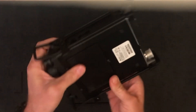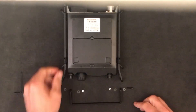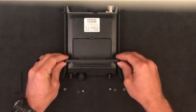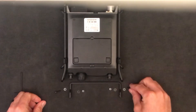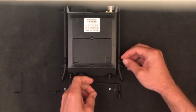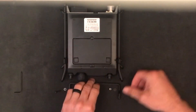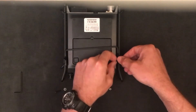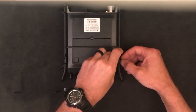So now we're going to install the stand that flips it up, which comes with a nylon washer to make it a nice smooth rotation. The stand flops down and then flips back up. Then you put in the bolt, the nylon washer, the stand, the steel washer, and then the nut.